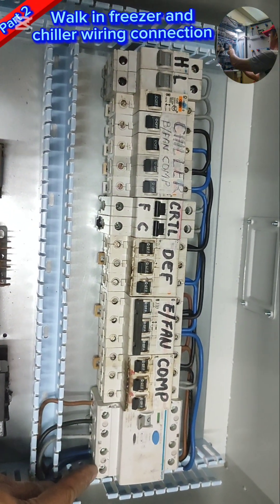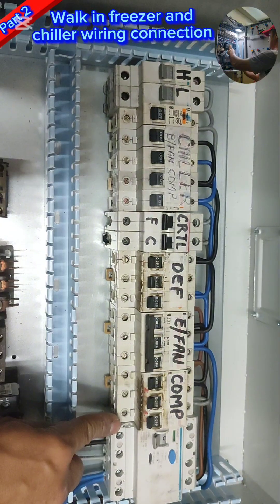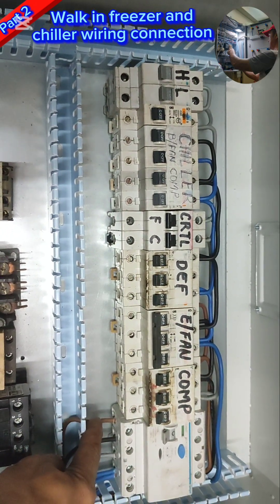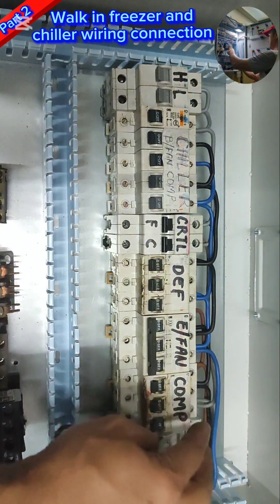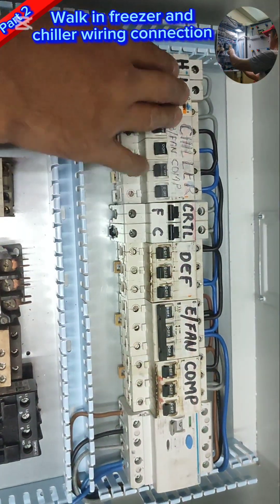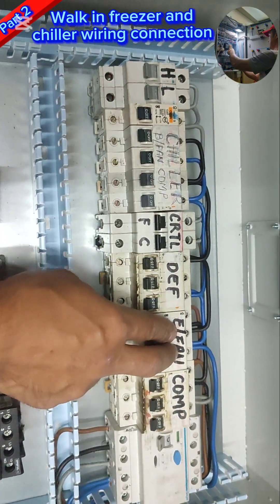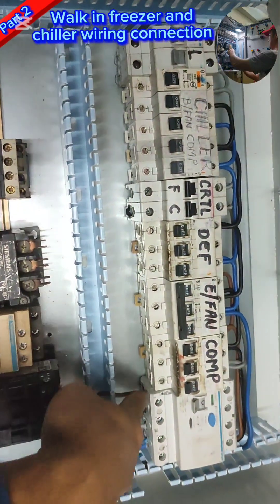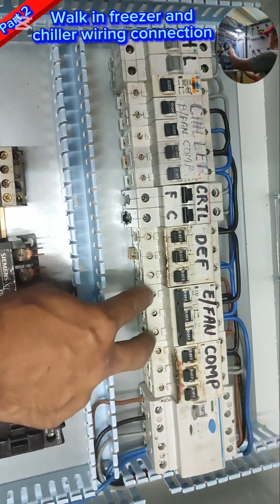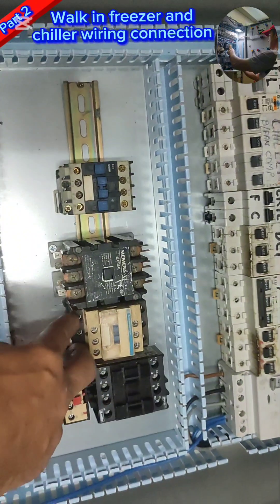Here's my RCD, and my neutral is blue. As you can see we have brown here for phase one, black for phase two, and gray for phase three. This one is rated 100 amps, but if you want to use the standard band, use only 35 to 40 amperes. Here's my three-phase MCB — but only the compressor is three phase. The defrost and blower fan for the freezer side will use single phase. This is my inline compressor and evaporator fan for my load on phase one.